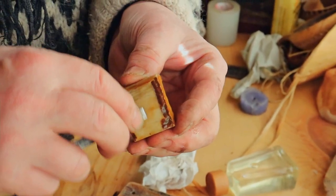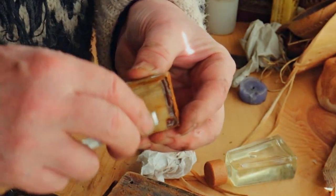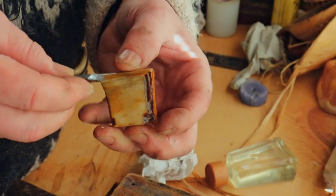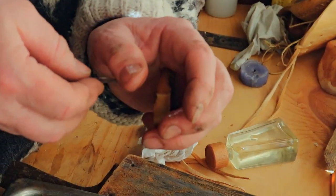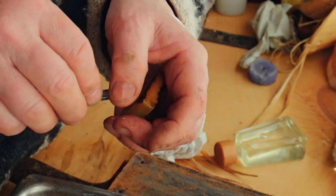I'm going to jump right onto this fine stone. But if you did use the medium stone, you would only use it on the beveled side — because why scratch up the side that you're trying to maintain flatness on?